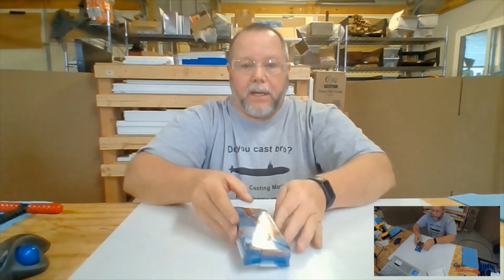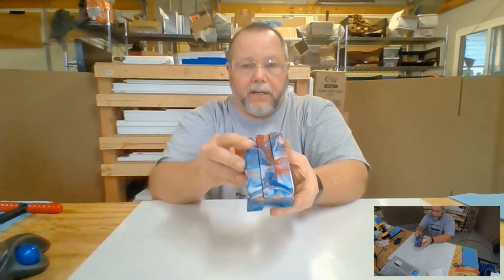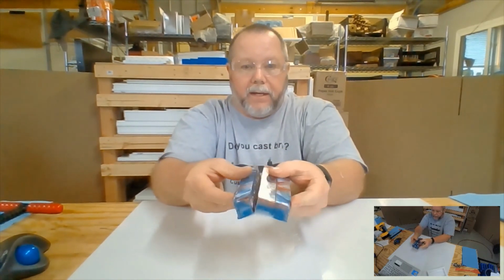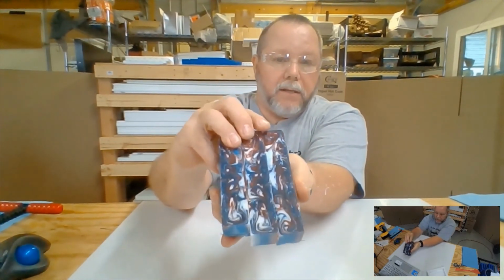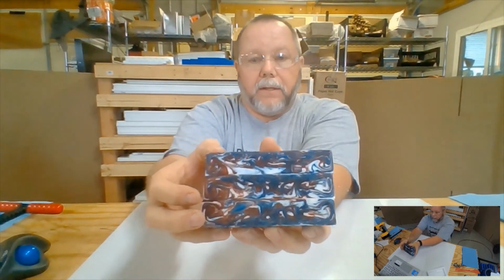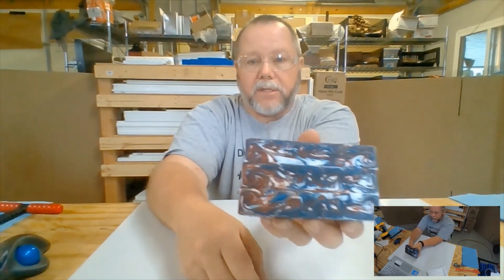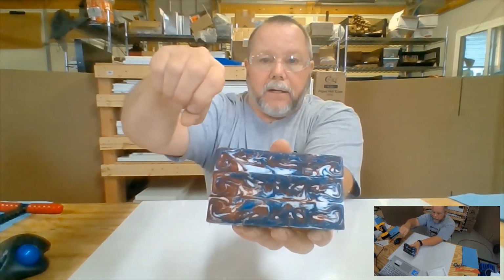All right, so we're back from the table saw, and this is the blank that we cut. I left it in the same orientation. If you open it up, you can see that there is really good color separation and definition between red, yellow, and white, or red, white, and blue. So the temperature we poured at was about right. Now it just comes down to height of the pour, stream thickness, and at the end, the stirring.